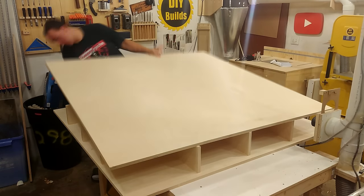The last thing to do on the torsion box is to add the two pieces of DIN rail to either side. These are going to be our linear guides for the gantry. To install the DIN rail I'm just using a jig to keep the spacing the same on the top, bottom and middle, and everything is kept in place with a whole bunch of 1-1/4 inch washer head screws.